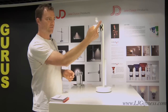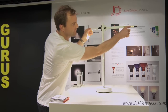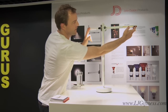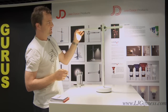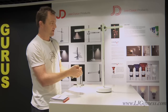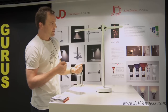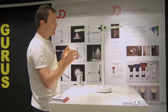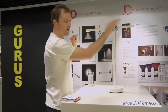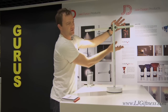The technology I've used to allow this to happen is a heat pipe. You see this copper tube here. Heat pipes are used in satellites and computer processors, just to take the heat away from hot objects such as semiconductors and drivers. What we're doing is taking the heat away from the LED chips very fast and dissipating it along this arm so that the heat is released on this heat sink.